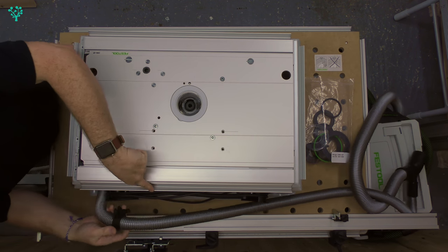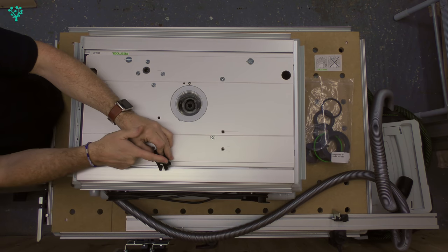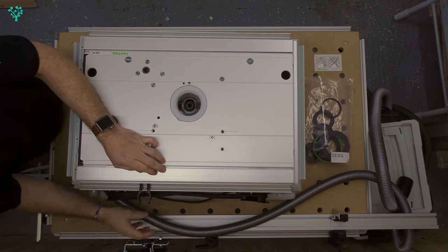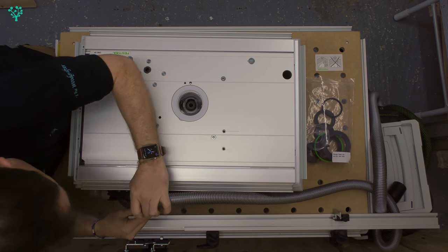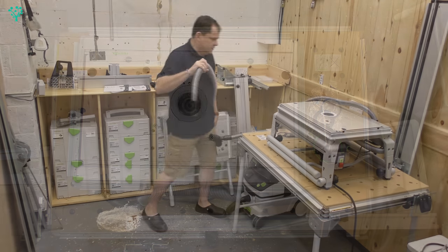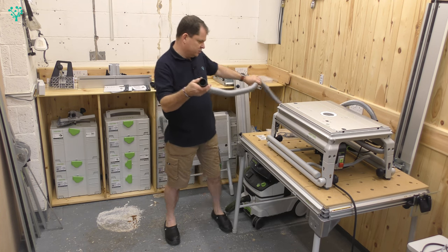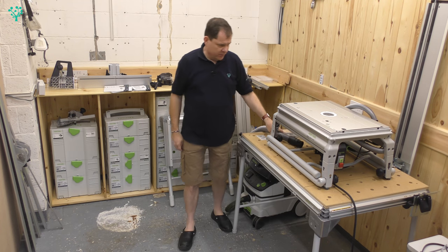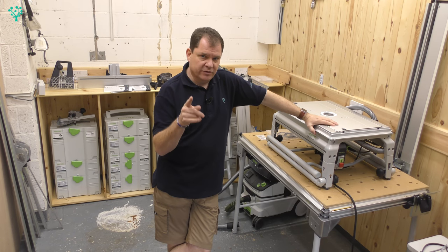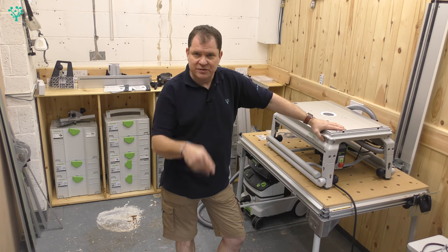We can use this clip to just clip to the V area at the back of the table. There are three prongs on this — it clips on with the two prongs at the top and just clips perfectly into position. That allows us to make sure that cable is not going to catch on anything. That manages the dust extraction of the table, and this will then manage the dust extraction on top of the table. What you now attach to the top depends on the job that you're doing. We now need to look at the fence, and we also need to look at what I call the free-routing dust shroud. We'll do that in the next video.